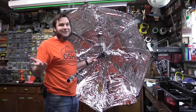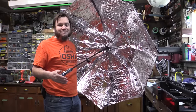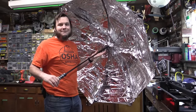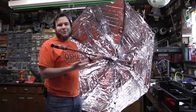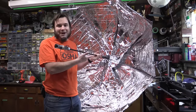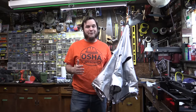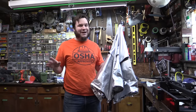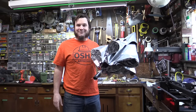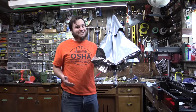If you did this yourself, you could get one that's very portable — bring it camping, to remote locations, on canoe trips, backpacking, off-grid or emergency prepper situations. And you don't even have to make it at home: if you're on a road trip with just the SDR, Sawbird, and a laptop or phone, you can go to any store that sells umbrellas, spray adhesive, and emergency blankets and assemble this in less than an hour. The obvious drawback is that even the slightest gust of wind causes the dish to wiggle out of alignment and you lose your signal — slightly stronger wind and this thing is in the next county.